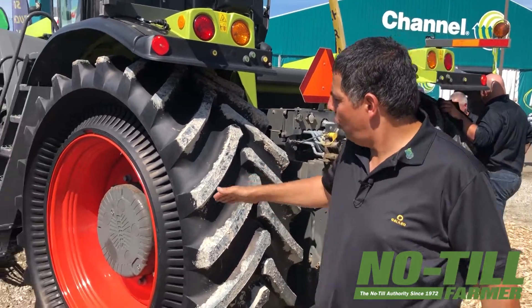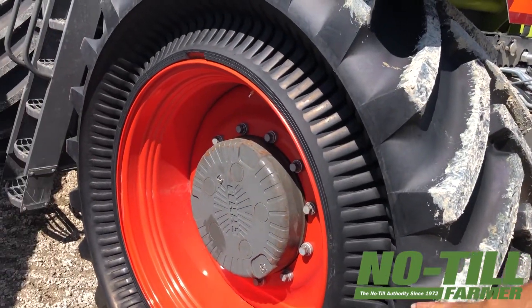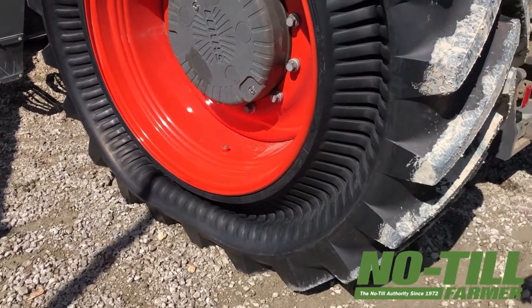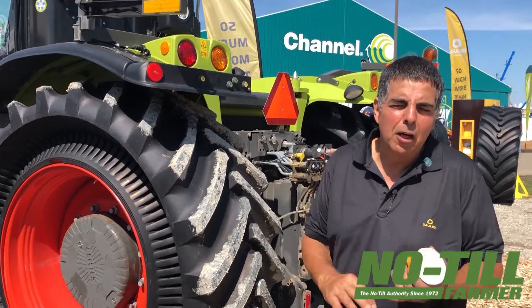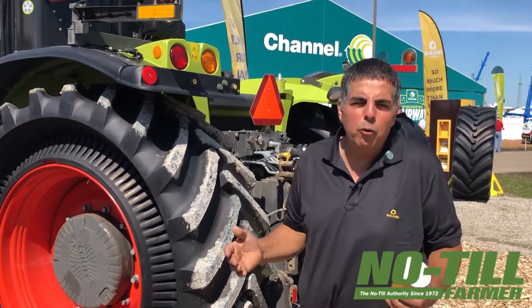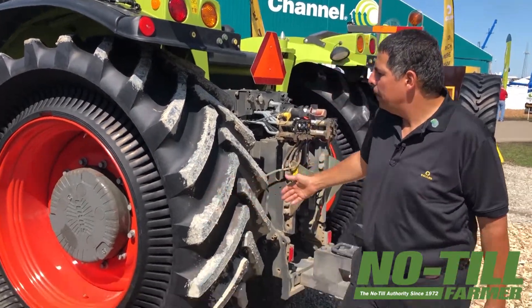What is more interesting — look at the shape of the tire. A normal tire, definitely with such deformation, you can imagine how the sidewall would look when it goes near the ground: it would be bulging out. And you can imagine what a sugar cane, or a corn stalk, or some spike left on the field would cause to the tire — it would make a slit on the sidewall, on the most vulnerable place of the tire. A slit in that place would normally mean a total loss for the tire. These tires cost a few thousand dollars each.